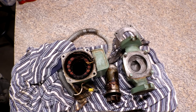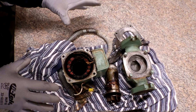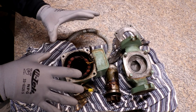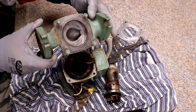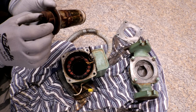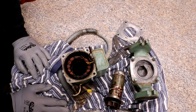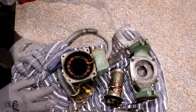I changed a pump on my solar hot water heater — it wasn't working for a few months because I just didn't have time to get to it. One of the pumps was bad. I spent a good amount of time cleaning it, and found the wires were just shorted and burned up inside — that's why the pump wasn't working. Before I cleaned it, it was just full of muck water and nasty black residue. The cartridge still spins but I wouldn't use it again. Inside was just full of nasty crap, and I'm not sure if it started with the cartridge or a seal.